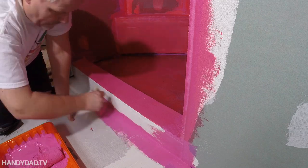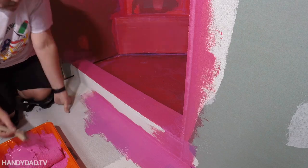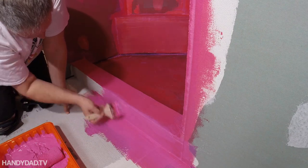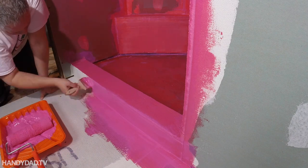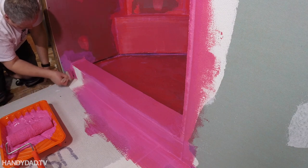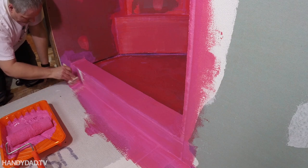I also did about six inches in front of the curb — that's what Bob Doyle recommends. You don't have to do the whole floor because if water gets underneath there it's just going to go under your baseboard anyway, but just in case there's any incidental water that might come over the curb from drips getting out of the shower, it's protected there.